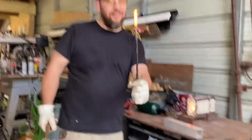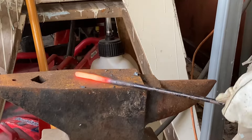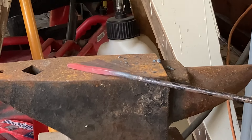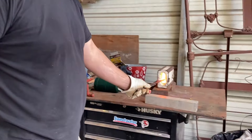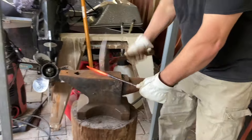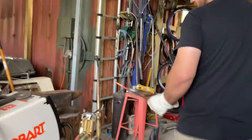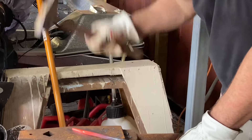This is not enough to work on yet — got it red hot. As the handle heats up you'll get a little more time with it, but that's about as much as you get with that kind of stock. Throw it back in the fire and back up to working temperature. Now I have the diameter that I want, so I'm going to round it back off.